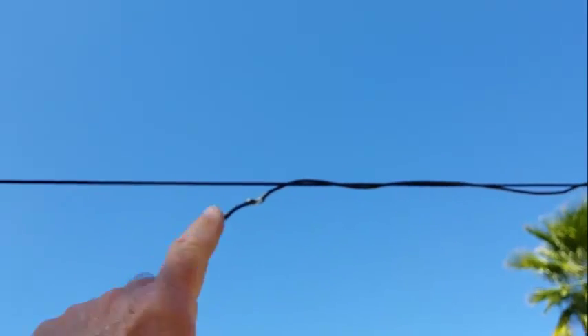When I first put it on the air today, it was flat at 3880 with the additional 4-inch jumper. I took the additional 4-inch off and it was flat at 3980. I'm good from 3960 up to 4 megahertz with this configuration right now.